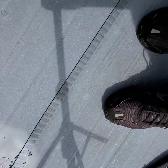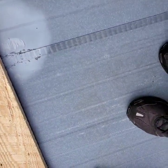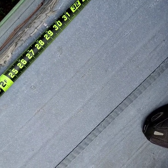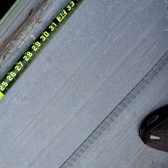And then the next run of boards needs to be set at 1 foot. Sorry about that. So the second run of boards is going to start at 2'4", because it's a 1x6, I split it by 3 inches both ways. And if I do it at 2'4", my screw line is going to hit at 2'7". So that leaves me plenty of room, 3 inches to hit the center of that 1x6. So with a 5-inch overhang on our materials here, the next set of boards is going to start at 2'4", with our screw line hitting at 2'7". But I will show you guys when we're done to give you a better overview.